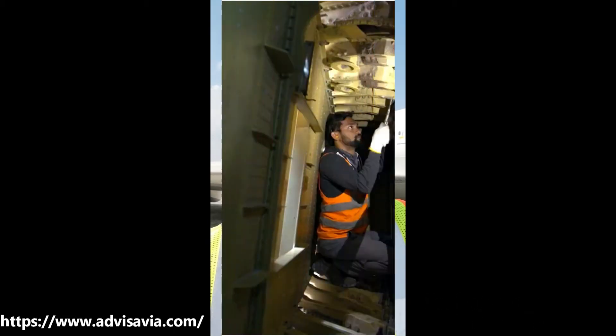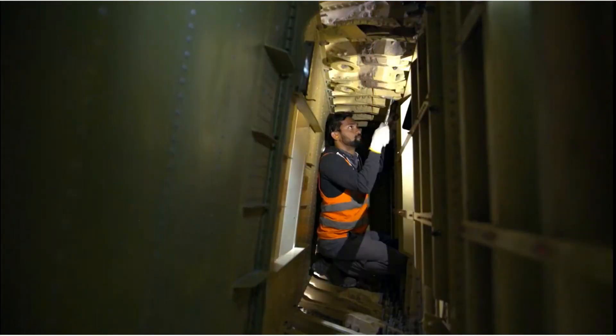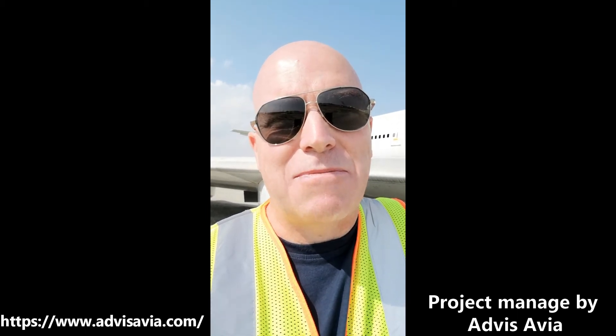We had to send somebody inside the wing while it was still attached to the aircraft, and they essentially had to unbolt about 240 to 250 bolts on each side. These bolts have been in place for almost 40 years. They're covered with a kind of caulking or mastic type substance that turned to steel after sitting there for 40 years, and it was not a nice job.